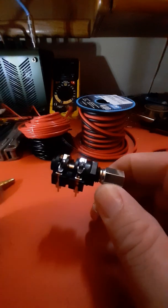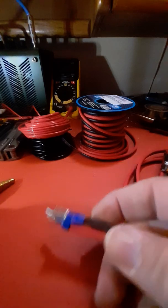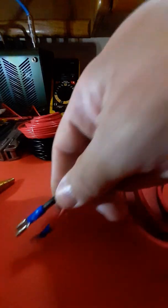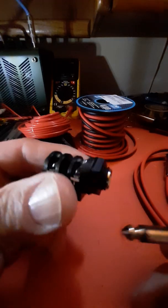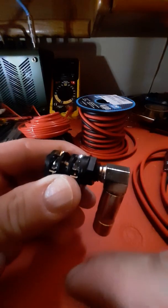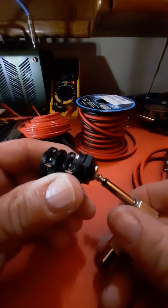The other ends of that cable you can either solder directly to the speaker — making sure you remember positive from negative — or you can put some spade connectors at the end of the cable you ran through and reconnect that to the speaker. You're golden. You'll have a fully operational active speaker out. Get yourself a cabinet and a speaker cable, and when you insert that speaker cable in there, your internal speaker will be disabled and your cabinet will be functioning.